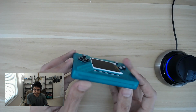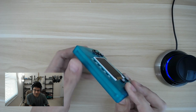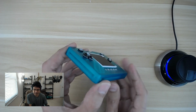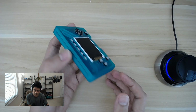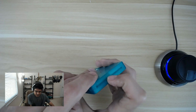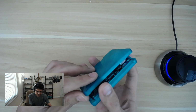Another noticeable thing is that there are these chamfers on the edges of the case. And what are those about? Well, they do two things. First thing is that they indicate where the snap-fit features are. The second thing is that they help you open this case when you want to open it. So the way to open it is you get your thumb here, your fingernail, and then you get another finger on a different side. So when you clink those together, that unclamps it.